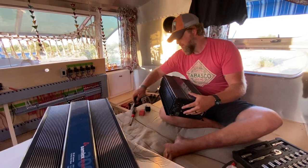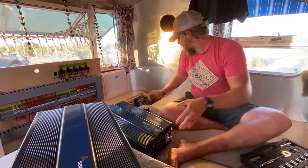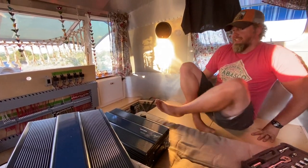After we finally figured out the plumbing, we had a huge power problem. What we didn't realize is that this pump said it ran at a certain amperage on 120-volt, but it had a startup amperage of like 10 times that, which they didn't list anywhere. So our inverter couldn't handle it. We thought we'd just get a bigger inverter — at this point we'd spent $800 on an inverter and hundreds of dollars on plumbing fittings.